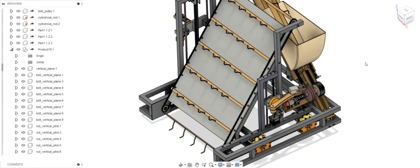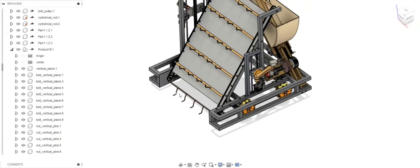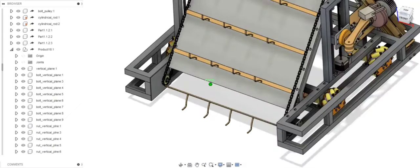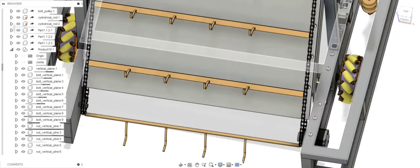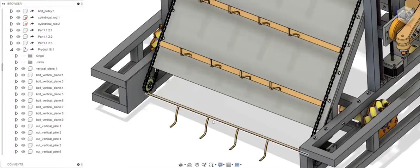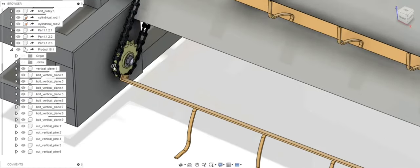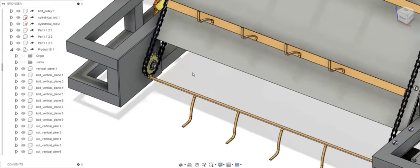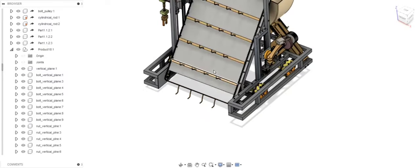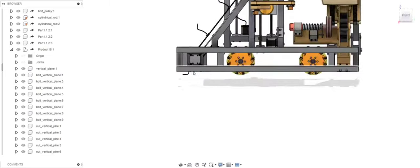The defense robot has one very major task of collecting the various arrows that will be lying around in the arena. For that purpose we have used a conveyor belt mechanism driven with the help of a chain and sprocket mechanism. A sprocket is rotated with the help of a motor, and there are hooks fixed to this chain.